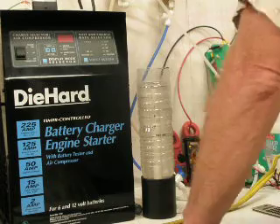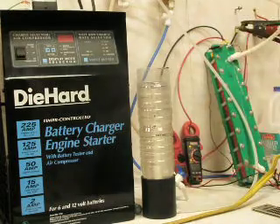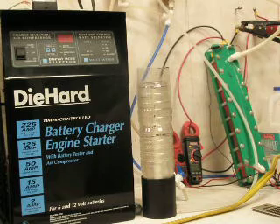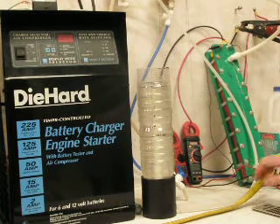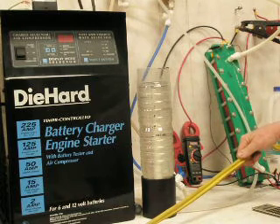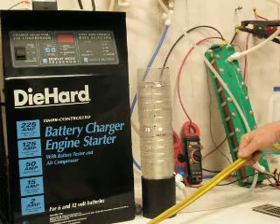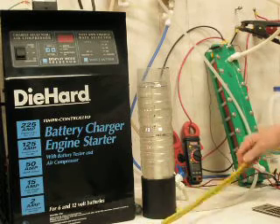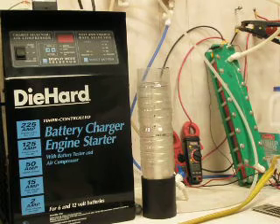Today I'd like to talk about power supplies. Right now, this cell right here is running on two large batteries from my truck, through this cable right here, which is a fairly large cable. It's a 6-gauge cable, about 12 feet long.